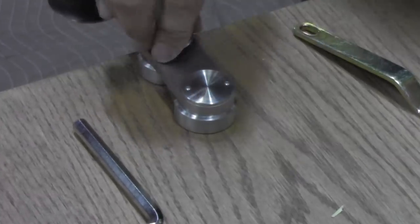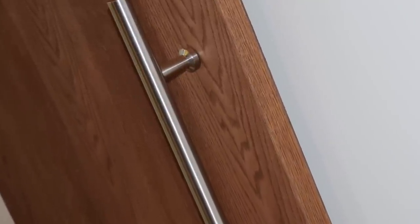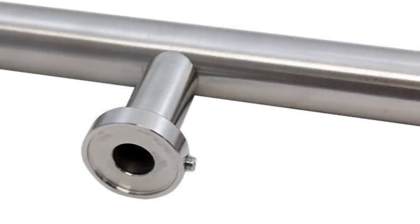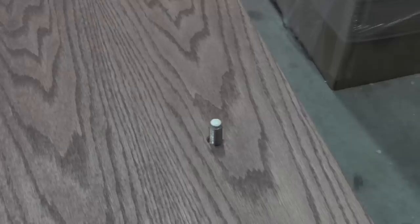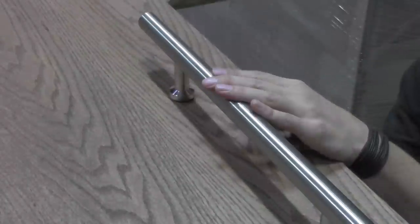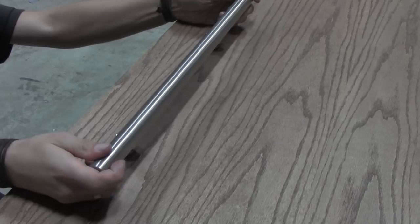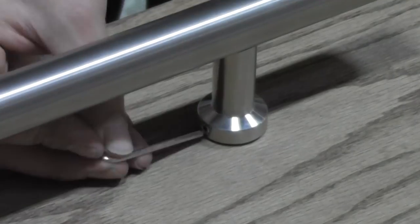Note that the hardware included can be applied with left or right orientation to slide in either direction. Determine which direction the door will open and then apply the door handles accordingly on either the left or right side of the door. Drill holes for your handles at 11 and 13/16 inches apart on center. Apply the pin with the washer through either one of the openings, then insert a washer over the bolt on the other side and secure the handle in place. With the mounting post of the handle in place over the threaded bolt, tighten the nut from below and repeat these steps for both the top and bottom posts.